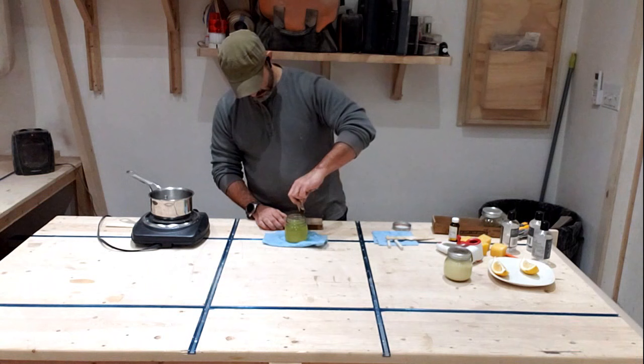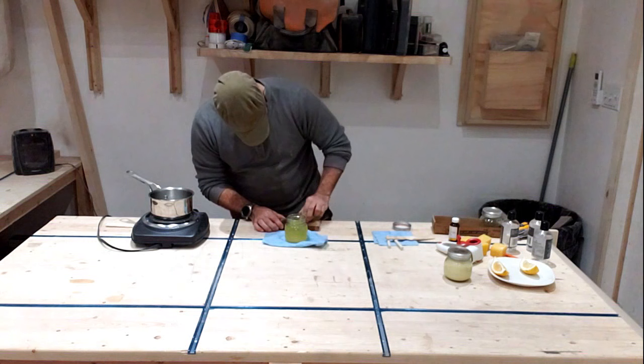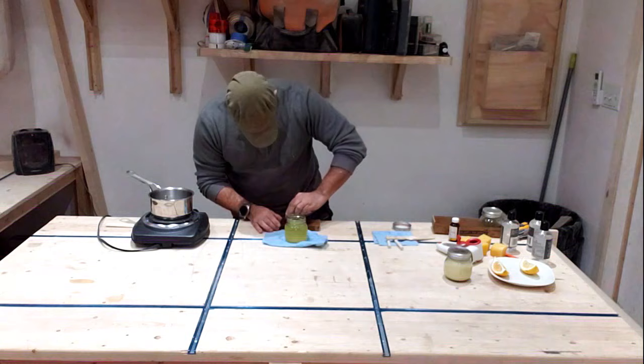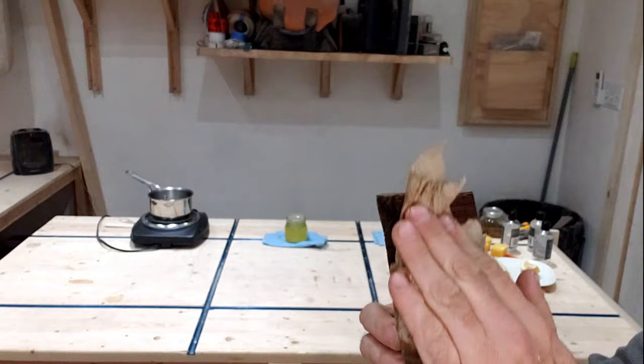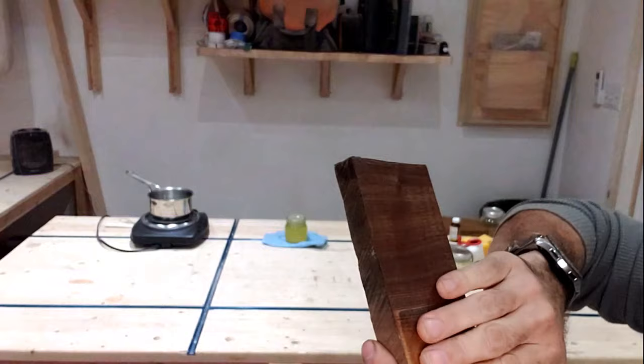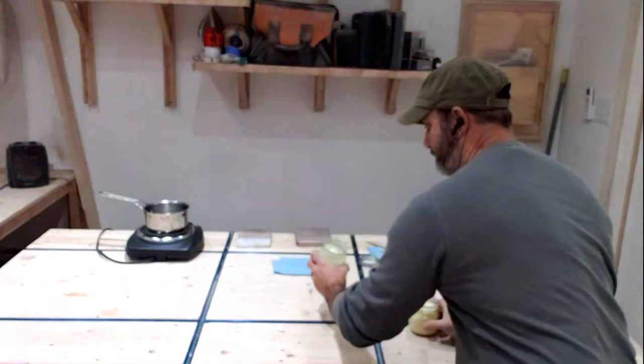This time I wanted to check that it wasn't going to bring up the grain again. I had a piece of wood sanded down to about 360, so it was pretty smooth, but I wanted to make sure it wasn't going to water-pop the end result so you'd end up touching your newly finished piece and all the grain has been brought up to the touch. And this came out beautiful — I was really happy, extremely smooth, great look, great protection. You can see the waxy protection on it. Everything was working out amazing. So that was the first one — a little thick. And this is the new version with the 20% wax to the rest mineral oil, and as you can see it's a much, much easier substance to work with.